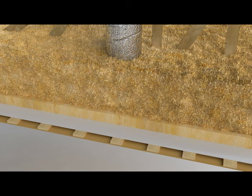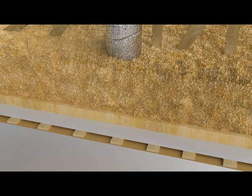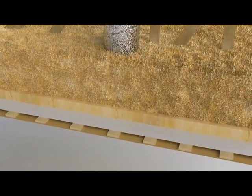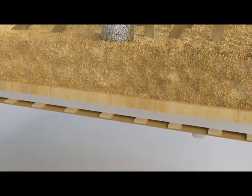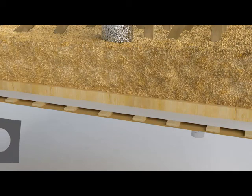When a duct is run from an attic space into room areas through moisture barrier plastic, the duct should also be insulated at the point where it passes through. This succeeds best with the Isover Vario feed-through seal, which has been specifically developed for the purpose and is available for all duct sizes.